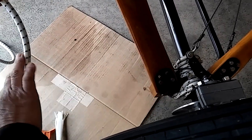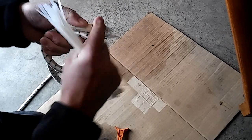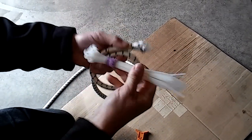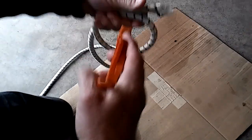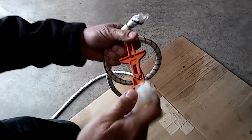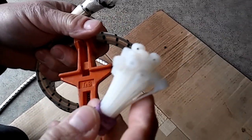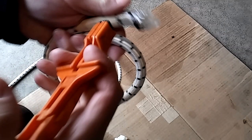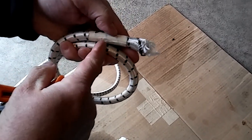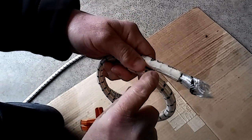We take this and loop it around the axle one time, like this, and then take tie wraps and wrap them a couple times — maybe six of them in a row. I use a tie-wrap gun to pull them tight, which you can buy on Amazon. You want good quality tie wraps, not cheap ones. You can use radiator clamps or safety wire, but I don't like either of those because they tend to chafe into the bungee cord.